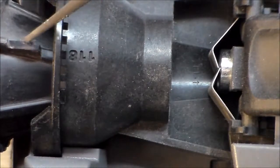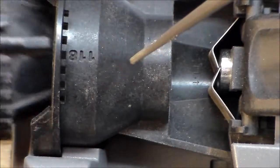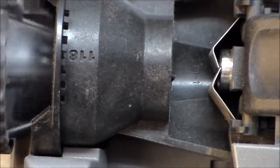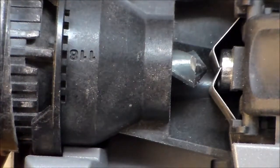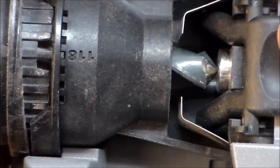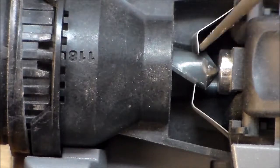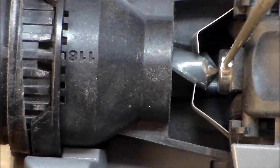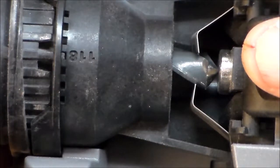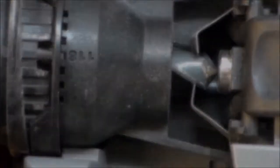Let me show that one more time. This plastic element here — I rotate it, there's one on either side — it doesn't matter which, but it must be at 118 degrees. Position the drill so when it goes in it grabs at the narrowest web, with the end of the drill up against the metal stop. Do those three things right and you're well on your way to a nicely sharpened drill bit.